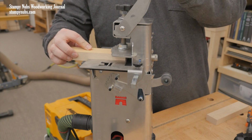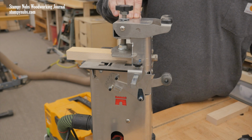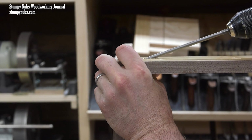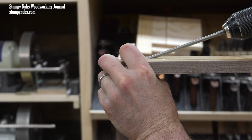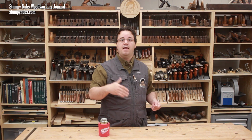That said, the angle of the screw pocket itself can also be a factor in choosing the correct drive. For example, this machine cuts a pocket at a very shallow 3 degrees. There are a lot of benefits to a 3-degree pocket, but some folks tend to hold their driver at steeper angles. Perhaps 6 or 7 degrees is more comfortable. A square drive tends to keep your screw aligned with the driver whatever angle you're holding it at. So you may inadvertently change the angle at which the screw enters the mating piece, and that could reduce the benefits of your shallow pocket.